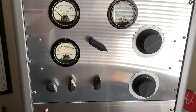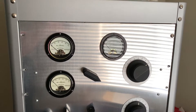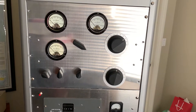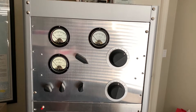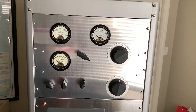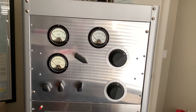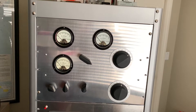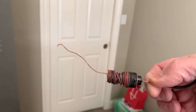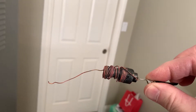Something dawned on me — I don't know if you remember that PAL 351 amplifier video I did a while back where that 2.5 millihenry high current RF choke melted on me. When I built the remote tuner box out there on the vertical — the 80 meter ground-mounted quarter-wave vertical — I had put one of those chokes across the element to ground just for corona discharge. I went out and pulled the box off and found that the choke had kept melting and melting, and when I got on 40 meters yesterday, it just went kaput.